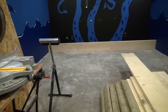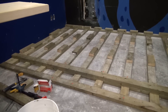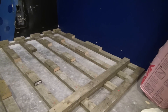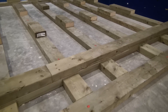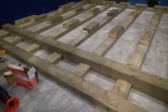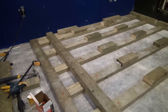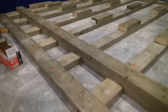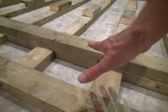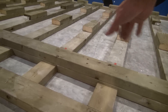Okay, let's see where we're at. I have laid down the foundation pieces — notice they are treated lumber, treated just for the bottom layer where it touches the concrete, rather than using plastic and untreated lumber. This front part here is my step, and the step will be about eight inches, and the back will be 16 inches.